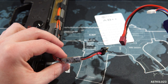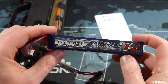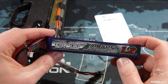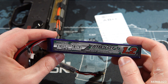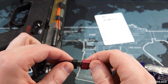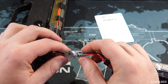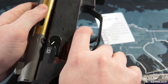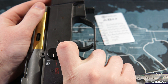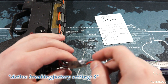Now I'm going to demonstrate how to program the MOSFET — it's actually really simple. I've got an 11.1 volt here, 15 to 25C, 1200 milliamp hour. The MOSFET can use 7.4V and up to a 14.8 volt, so you do have voltage options. 11.1 is probably the most I'm ever going to run on an airsoft gun. This gun does have the stock original motor in it, so the rate of fire is not going to be super fast. I plug it in, get a little green LED light and a beep. Stock factory settings are semi and full auto with active braking set to one.